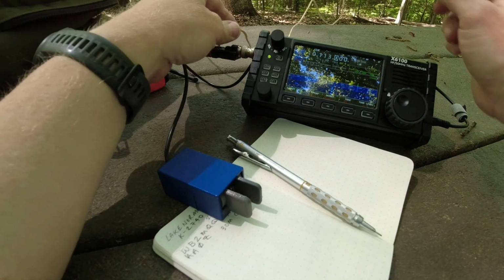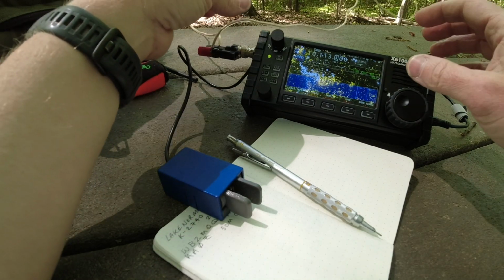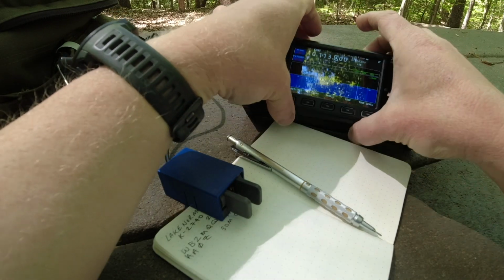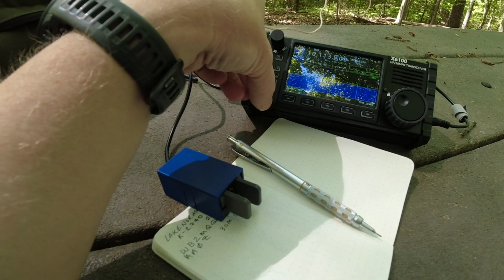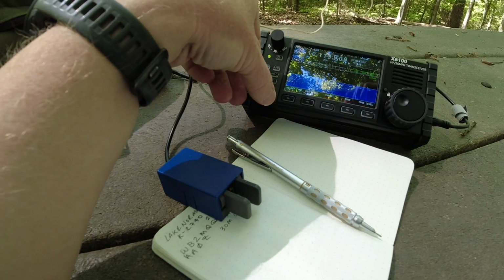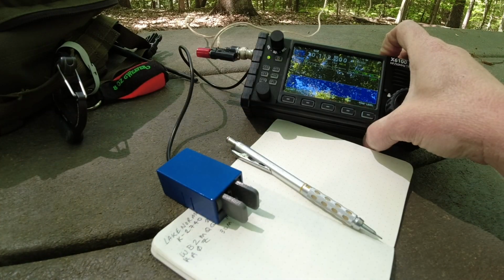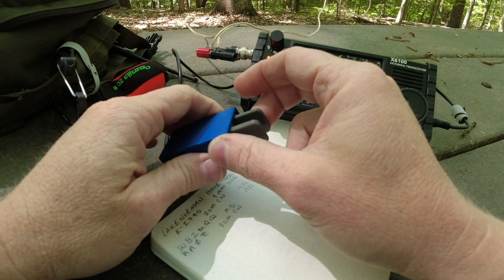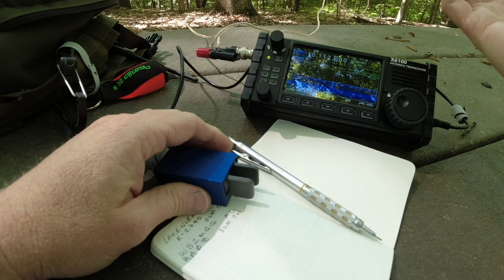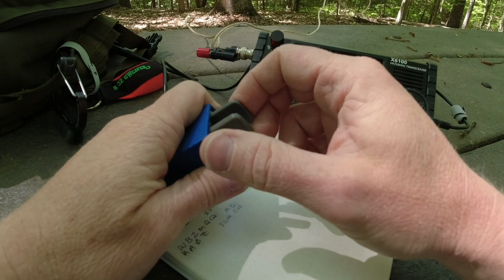This is not giving me a great SWR. I wonder why that is. This is very strange. I would have expected this antenna to do better than this. It did better with this than my KX3. And the TX power won't go above 4 watts, and that may be because it senses that this is a little too much of an impedance mismatch. Okay, that looks like it was a 2-to-1. Oh, that's actually a pretty good one now. Okay. Looks like a pretty good match.